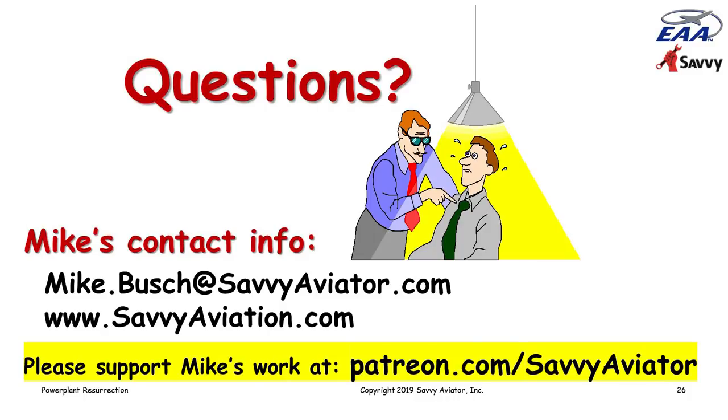A bunch of people have asked, let's just take Jimmy's question here. What items are involved in pickling an engine, and how long can pickling preserve an engine? Well, both Lycoming and Continental have service bulletins outlining the pickling procedure, and they're both pretty much identical. You do an oil change, and you put a special preservative oil in there, and there are a number of different preservative oils. Shell Fluid 2F is one. Phillips, I believe, makes a pickling oil. I forget the designation for it.